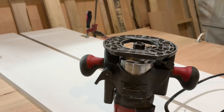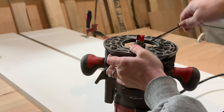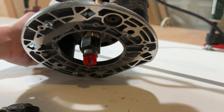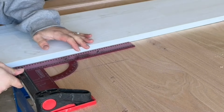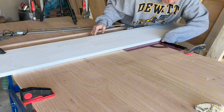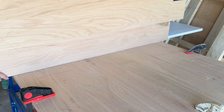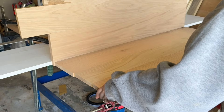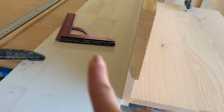I really pushed myself with this build. I am just gluing up the entire cabinet with wood joinery. It's really easy. I used a top-bearing mortising bit to make dados. Basically what you do is put a large board where you want your shelf, make sure it's nice and square, then you're going to slide your shelf in the middle and then slide another piece right up against it and clamp both of those side pieces down. This is going to give you the exact width that you need for your shelf, so you can cut your dado with your router.